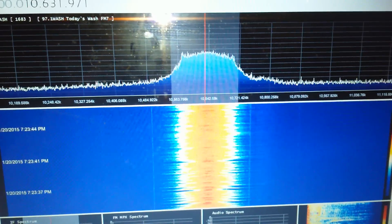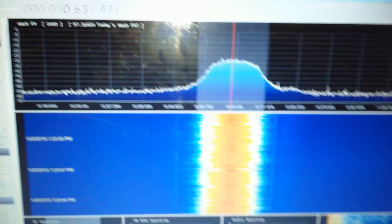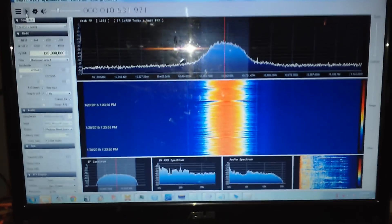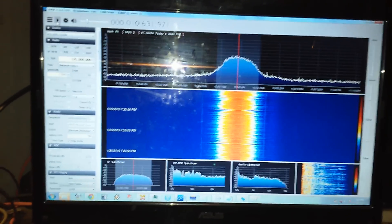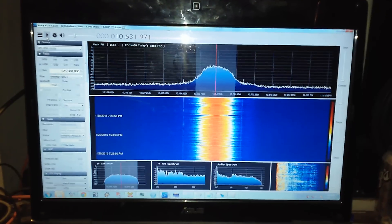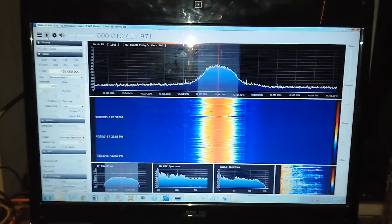Back when they were doing this stuff in the late teens and early 20s, these guys were inventing it by the seat of their pants, and it's kind of amazing it worked. In doing this I did notice a few things I totally expected. For starters, the Sansui front end — for being a cheap 70s receiver — is a little bit better than just the straight dongle and up converter. On AM I noticed a slight improvement in signal; there were stations that came in a little bit more clearly, and it was mostly noise floor — I had a much lower noise floor.